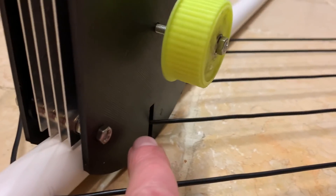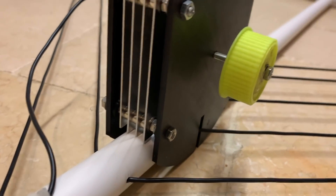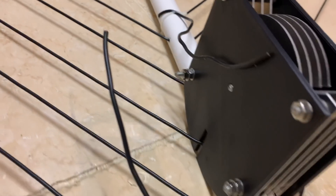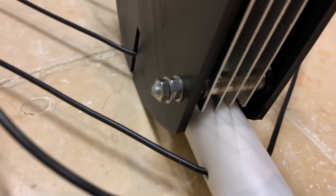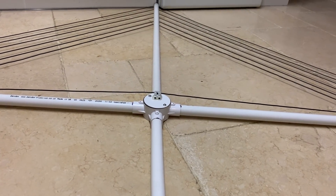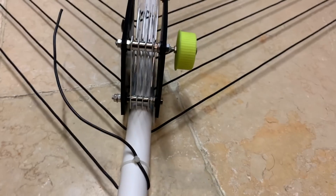So here's the idea - that's why there was a slot so that the wire could pass through it. What we do now is drill a small hole in the capacitor case here and perhaps the same slightly above, and we'll screw it into the pipe and also glue it. Then we'll bare back our cables, put some fork connectors on, and connect it up to our capacitor. After doing that we'll connect up some coax to our induction loop and put it out and see what kind of SWR we get.